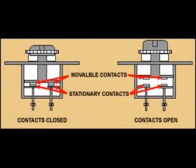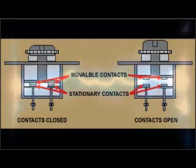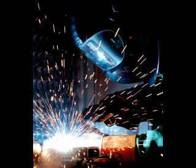For voltages of 220 volts and above, or for higher currents, a double contact such as this may be used. By using two contacts the distance an arc must travel is doubled. When contacts are opened quickly at high voltage levels, a conductive metallic vapor can form that allows current to continue traveling between the open contacts. This phenomenon, known as arcing, creates the greatest obstacle to circuit interruption.